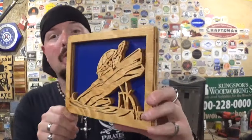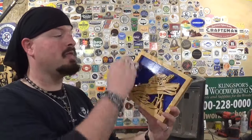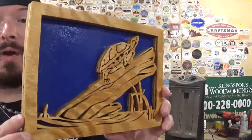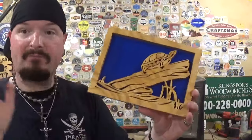This is the second time I've made this project — the first time was in front of people at the Woodworking Extravaganza in October, but I wanted to do it on film. I finished it the rustic way I like: staining the half-inch plywood scroll work with Minwax Golden Pecan, which doesn't mask off the natural grain. I gave it a dark blue background to make the details of the turtle, the log, and the water ripples really pop.